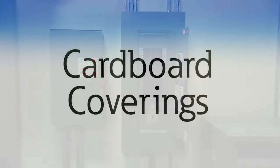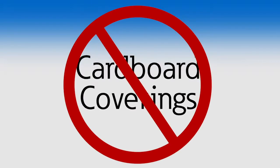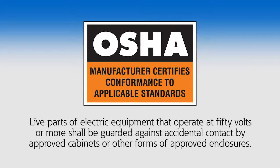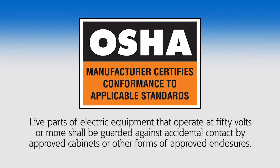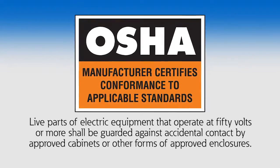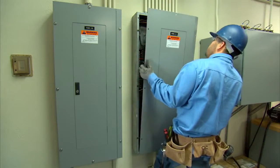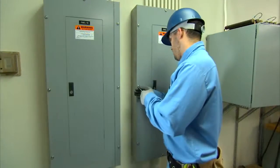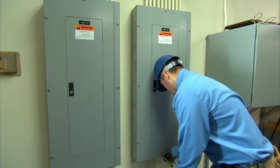Cardboard coverings are no longer an acceptable guard for today's safety standards. With current OSHA regulations, live parts of electric equipment that operate at 50 volts or more shall be guarded against accidental contact by approved cabinets or other forms of approved enclosures. Depending on the size of the trim type, and experience of the installer, it may take several minutes to install and several more minutes to remove. Consider how many times on a typical job the trim comes off the panel.